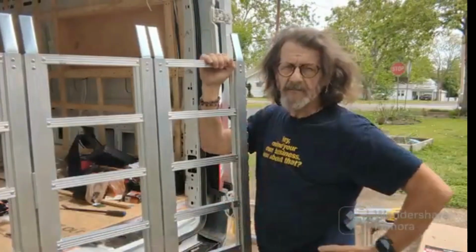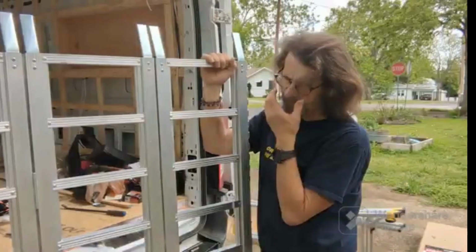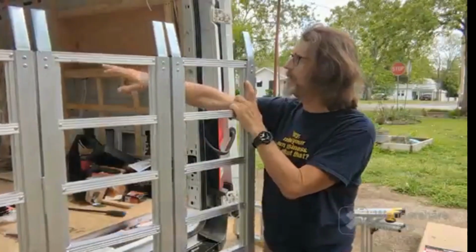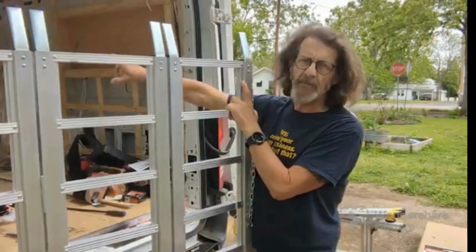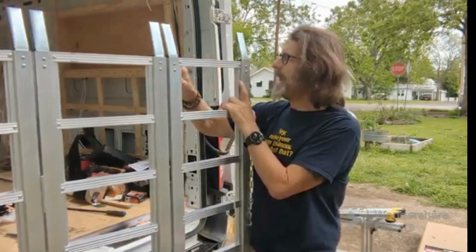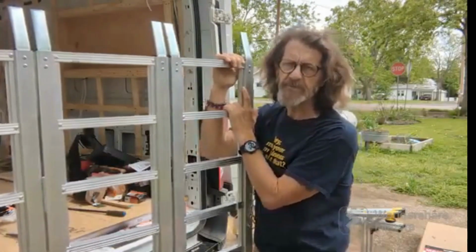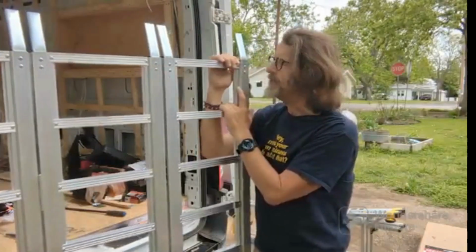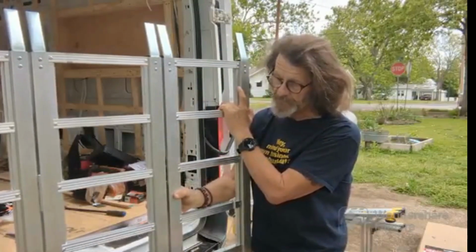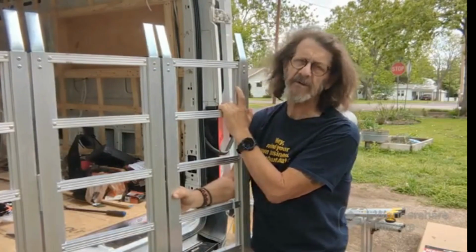to give the mattress support and let it breathe. And literally it'll fit right in between my rails. I'll put in a support bracket where this sits on top of, and then I will attach it with some self-tapping screws that will go in from the bottom onto our rails, and I will have a complete support system for the bed frame that only weighs 38 pounds.